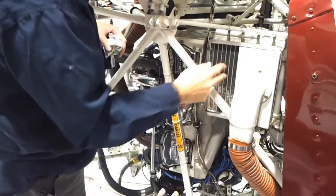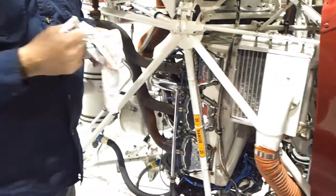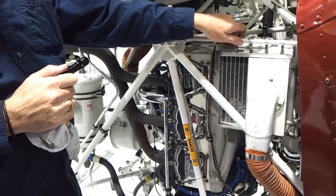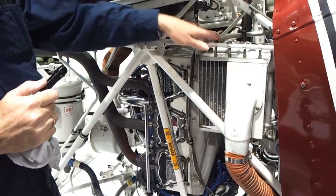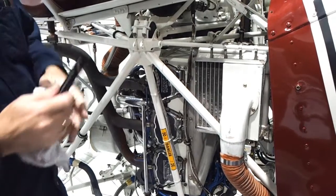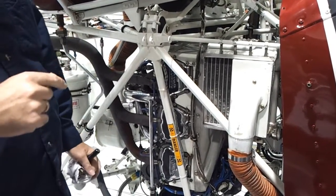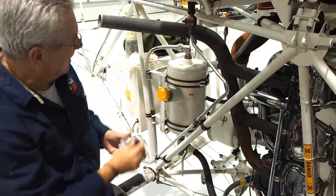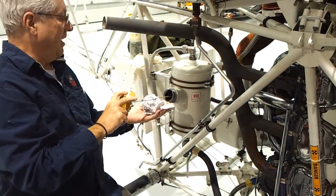The shroud is also attached to this — does anyone have any idea what that is? A cooler — because the air is going to blow through here from the backside out this side. What would it cool? Anytime you find something in the helicopter and you don't know what it is, look at the things attached to it. There's a hose pipe going in and a pipe coming out the bottom. That pipe goes along and into the oil reservoir.